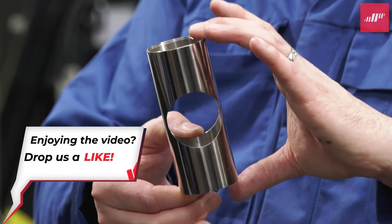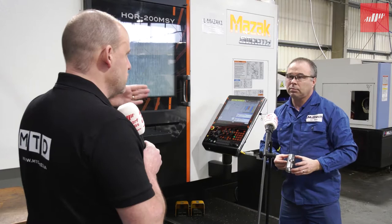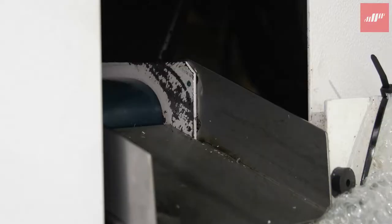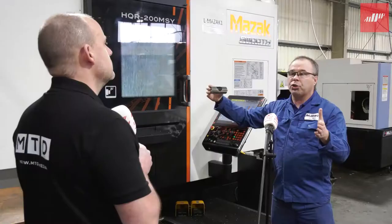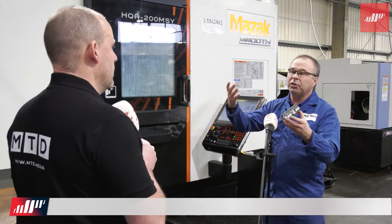We can then machine the drilled and tapped hole on the other side, and then when it's finished, we have an unloading arm which comes down, grabs the part, slides it out of the jaws, comes up, and drops it on a conveyor — and it rolls down to the end of the machine. To protect against damage on the conveyor, we filled the unloading hopper with bubble wrap to make it nice and soft, we minimise the number of parts unloaded at one time, and the loaders periodically take parts out so there isn't a large amount banging against each other. It's about just keeping on top of it — the machine runs, but you just keep unloading it and make sure that everything aesthetically and dimensionally is correct.